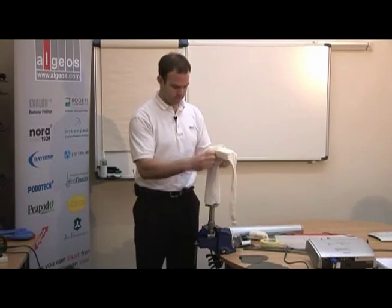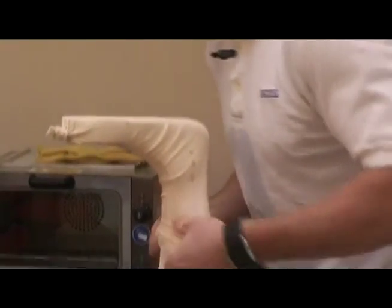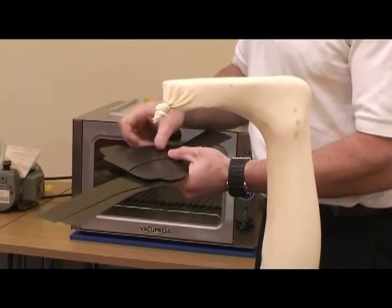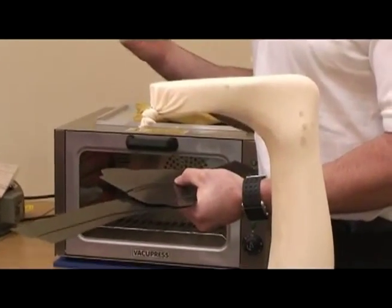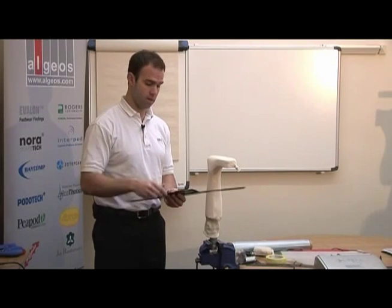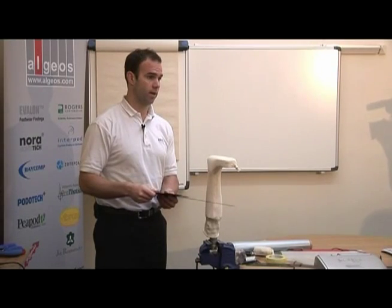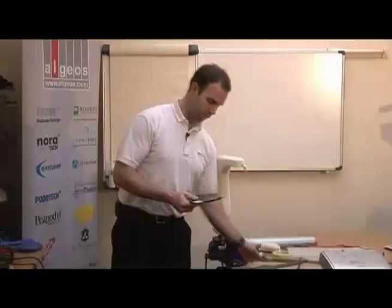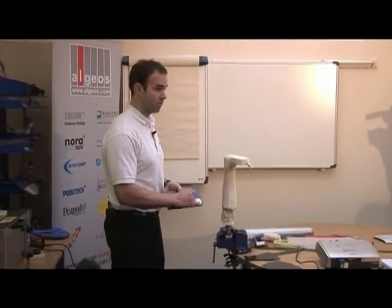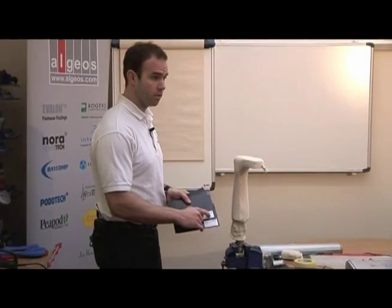We have a kit that we sell with three different sizes. This piece is cut out of a twill material. We have basically two kinds of materials: unidirectional, where 90% of the fibers are in one direction and 10% are just holding the material together, and bidirectional, where it's 50-50. This piece is cut at a 45-degree angle on the bidirectional material — pure carbon fiber. On the label, if the arrows are the same size it's bidirectional, showing 50-50. With a unidirectional sheet, the arrow shows the majority of fibers running in that direction.